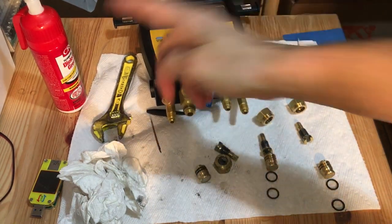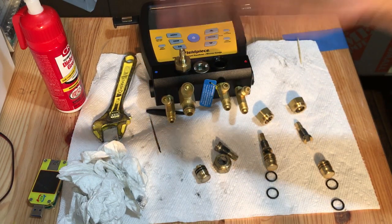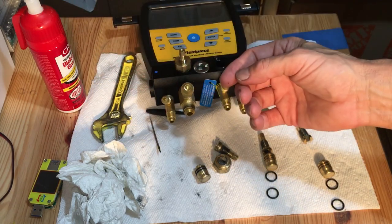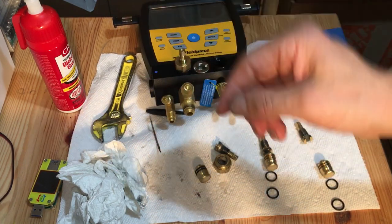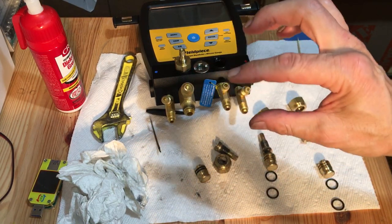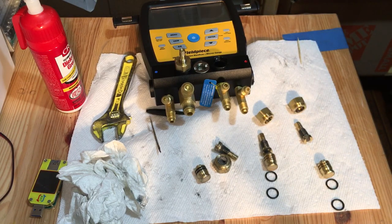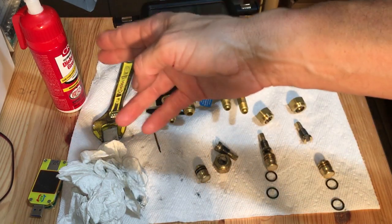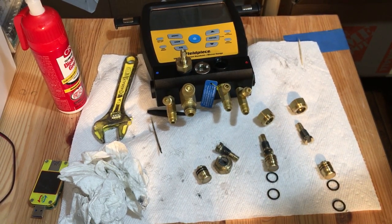That's it. This dielectric silicone grease — they actually sell special vacuum-grade silicone grease from shops that specialize in vacuum, under brand names. It's been dehydrated — under laboratory circumstances even regular silicone grease is considered wet, because it outgasses. You'd put your silicone grease in a vacuum chamber and draw vacuum on it to remove moisture before use. But that's only for laboratory work — you can pay a hundred dollars for a little three-ounce thing of certified silicone grease. For automotive or commercial HVAC, something like this is more than enough. See you guys in the next video.